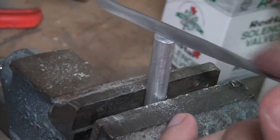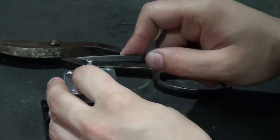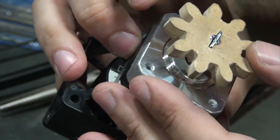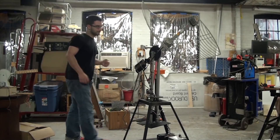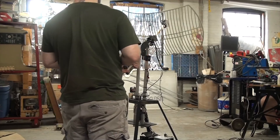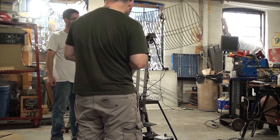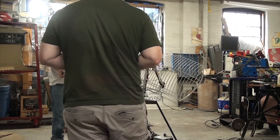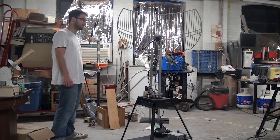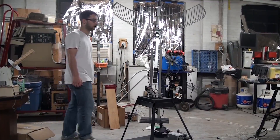When we built Cogsworth, you may remember that we had to add a key to the shaft that controlled the rotation to prevent it from slipping. Well, we had the same issue with the little drive gears, and as soon as the epoxy cracked the first time, both steppers had to be removed so that they could be keyed. After that, we didn't have any slippage problems with these gears. Throughout all of these changes, we were constantly firing up the system to see what was working and what was going wrong. During one of the later tests we were adjusting the weight so the arm was balanced well enough that the steppers could easily move it. After one such adjustment, we suffered a rapid, unplanned disassembly. At this point many of the other members of the hackerspace had arrived and quickly jumped into action to help out. It was at this point that we added that strip of duct tape to the bottom of the weights and to the armature to add more friction and prevent another RUD.